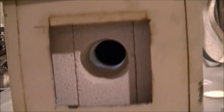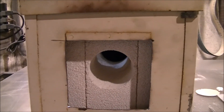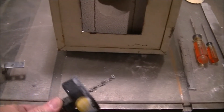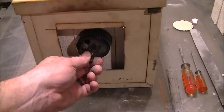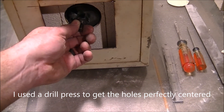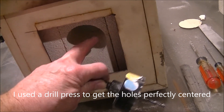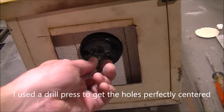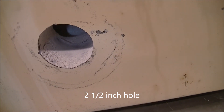To make the holes in the bricks - they're really close to the edge and thin. You need insulated fire brick specifically; the non-insulated stuff won't work because it transmits too much heat through it. To get the hole in there, I used a two and a half inch hole saw. A little bit at a time, I drill down into the brick as far as I could go, which is only about barely an inch. Then you come back out and use a little chisel very carefully to knock that section down about an inch, then go a little farther. Just keep going a little farther and chisel it back out until you get all the way through. Just take your time and you can make a perfect little hole. Then you do the same thing to the other brick for the side hole.